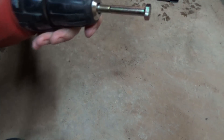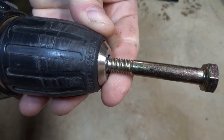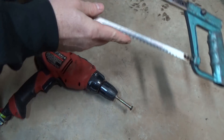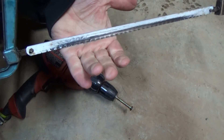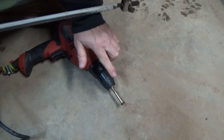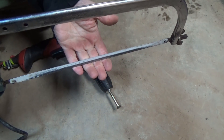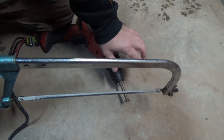I'm not putting a whole lot of pressure. I'll show you guys real quick — see the groove? It's already cutting into it. Now bear in mind the drill head, the chuck, is rotating this way. The hacksaw blade teeth — remember, if you put a hacksaw blade in correctly it cuts on your pushing stroke. So the drill rotation is like this, top of the chuck going this way, and I'm pushing against it this way.